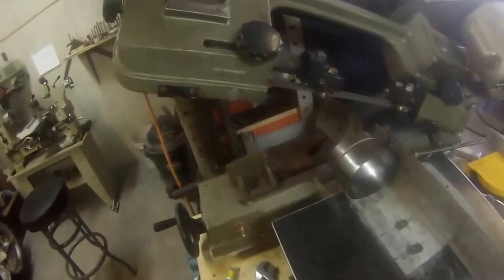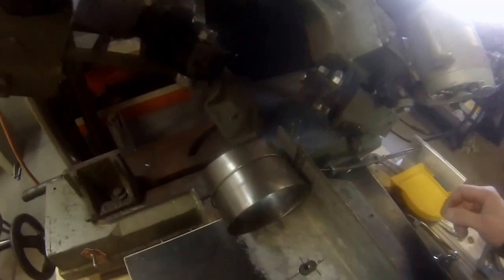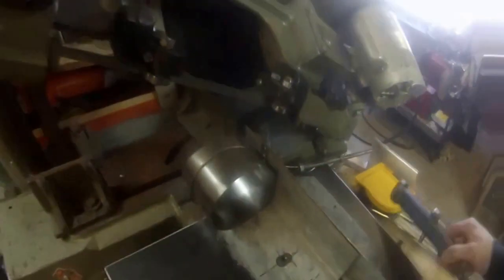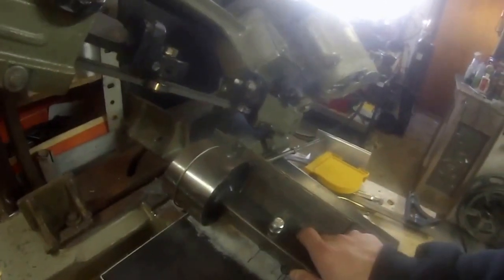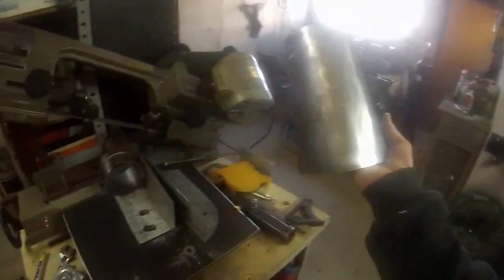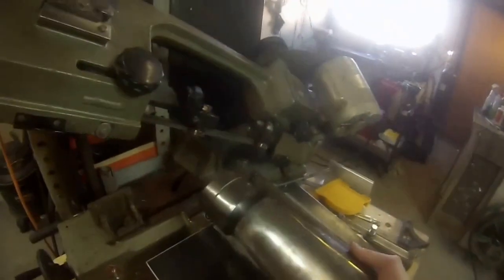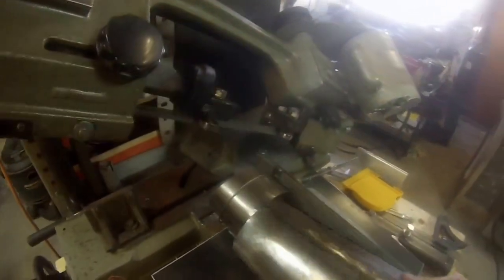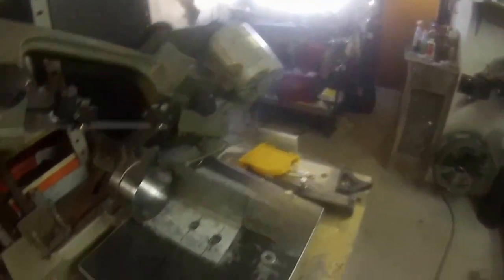As you can see, it's a little too small to clamp and cut — it would just wobble out and get destroyed. We were using this clamp to hold it down but that's not going to work this time. So we're going to take our next cone, our next section — this is stage three — and we'll weld it on there and then cut it, so we'll be able to clamp it down nice and solid so it won't get destroyed.